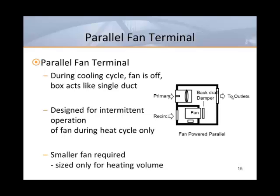damper. Since the air volume on the diffusers may vary during cooling and suddenly increase whenever the fan switches on for heating, extra care must be taken when selecting diffusers. The modulating airflow and unit fan cycling can result in significant sound level changes. These are all disadvantages of parallel fan boxes.